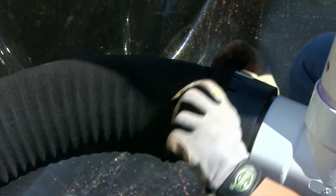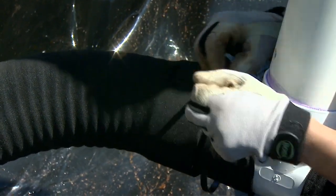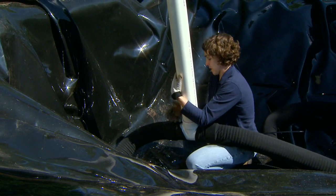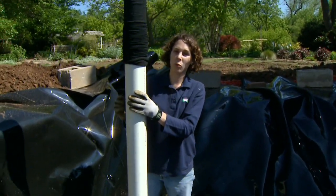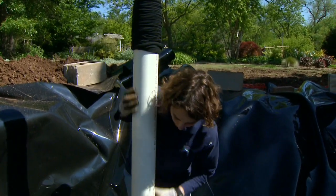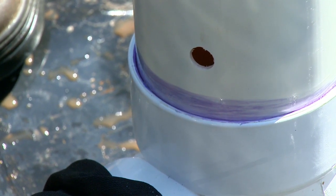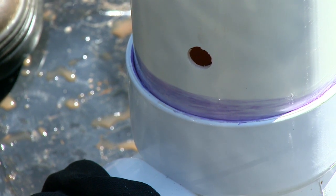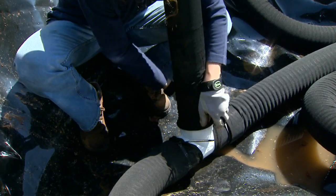I want to secure our fabric sediment barrier over that cistern, and I'm going to do that by simply using a zip tie to hold it in place. This other pipe attached to the T is going to be our vertical pipe, where our intake line for our pump will feed through. You can see that there are some perforations in this pipe that will allow water from the sand to move into our well from the top. You always want to make sure that you have your PVC joints sealed well, and that will keep any sediment from collecting through that opening. We'll cover our vertical pipe with our fabric and secure it at the base.